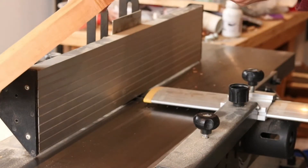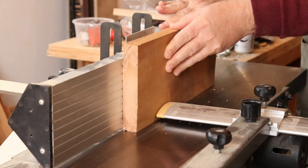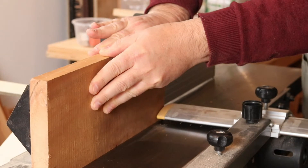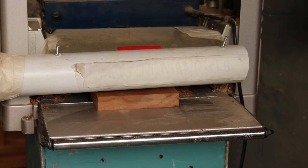You can see here putting it through and taking very small, very fine shavings through the edge using the jointer, keeping in mind that the wood is kept 90 degrees using the fence.